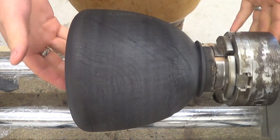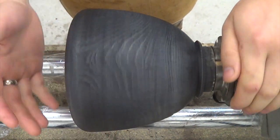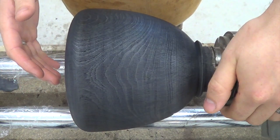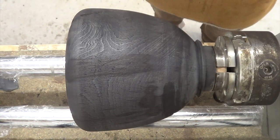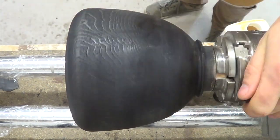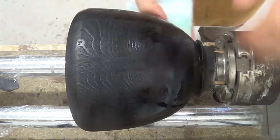It's morning now and the piece has pretty much dried off and I'm really happy with the colouring. It's uniform and the grain is still really jumping out, and it feels really smooth as well. The grain hasn't raised again since I sanded it the first time, so I don't think I'll sand it again because I don't want to end up making patches in the stain. So we'll apply some finish and see what the end result will be.